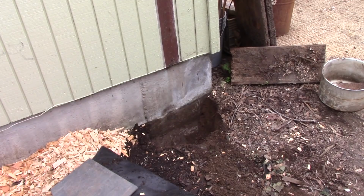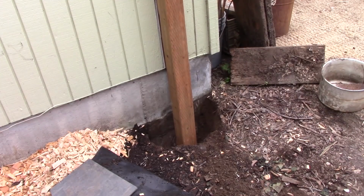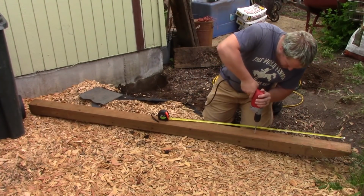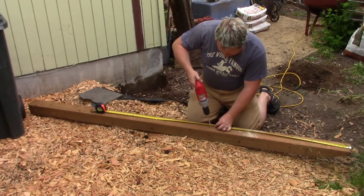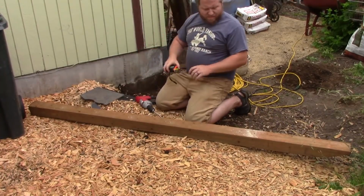One thing to remember is that you should use a pressure-treated post if it will come in contact with the ground. Otherwise, you will see your post rotting out in a year or two. The longest screws I am using on this project are 3 inches, which obviously won't reach all the way through a 4x4 post. What I will do is take a 1/2 inch butterfly bit and drill a 1.5 inch deep hole every foot all the way up the post. That will allow the screws to reach all the way through and into the wall.